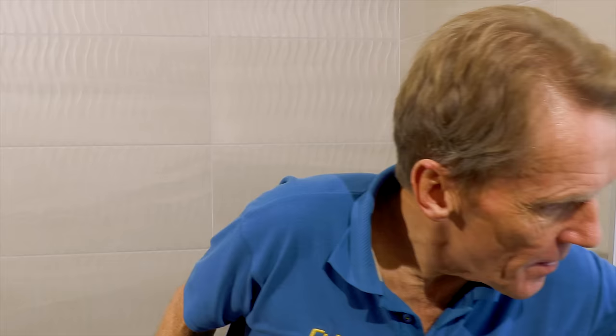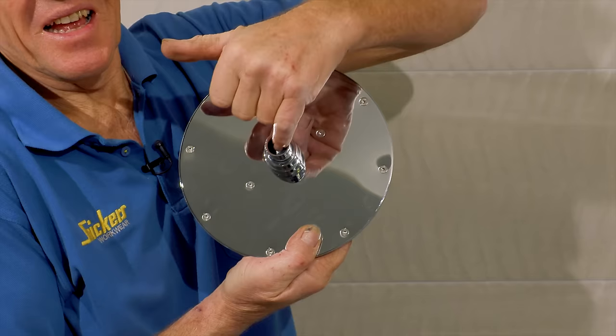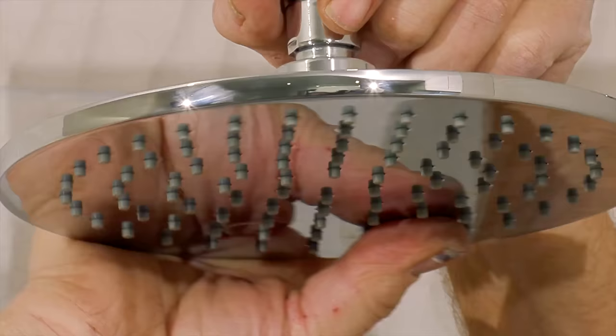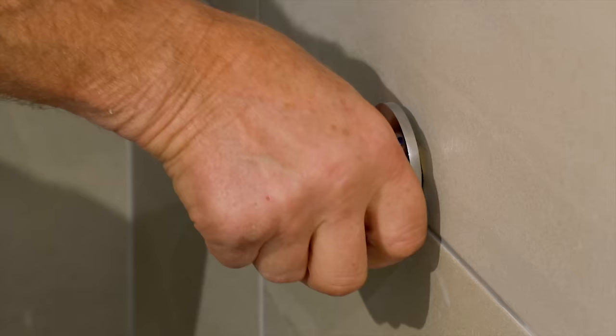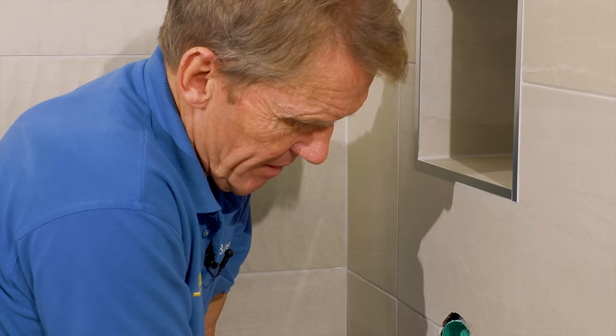The superclean head has a rubber washer in the bottom to seal it and a filter to keep out the worst of the scale, so no tape is needed - the rubber washer forms the seal. Never use grips on a chrome fitting. Listen carefully as you tighten - if you hear a crunch on the tile you know it's time to back off, because if that cracks the tile you've got a serious problem.